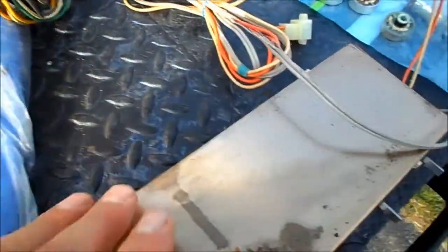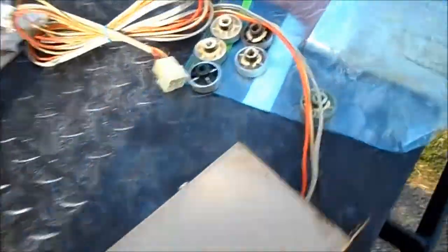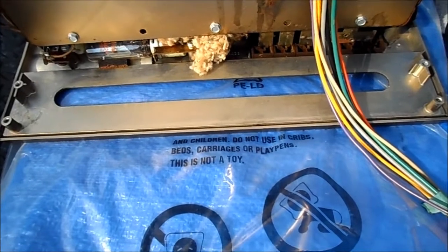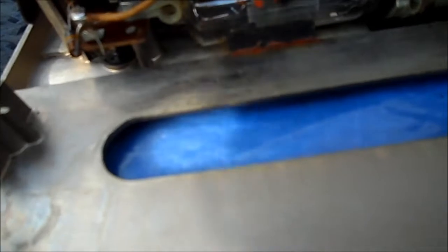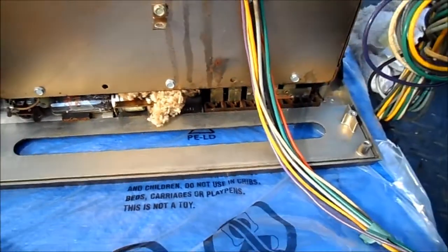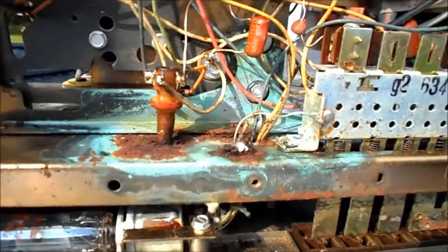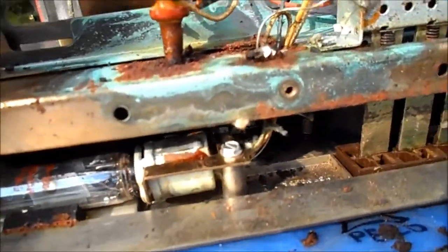Here's our preamp section removed. You can see a little bit of corrosion, but this is the preamplifier. The knobs came off and so did the plate, but that's no big deal. And there's our remaining — we have to get out right next to the eye tube here. Get that mess out of there. With the cover of the radio removed, even more crud. Hopefully that coil is okay — it should be. Just corrosion, and we're going to hit this with the spray wash a little bit right there.